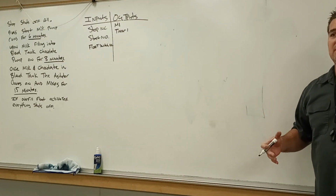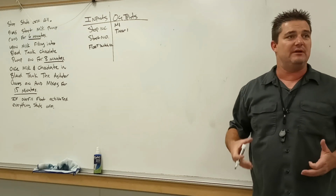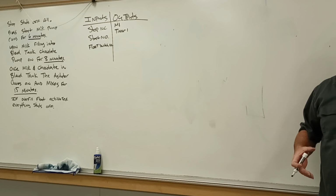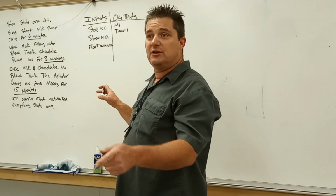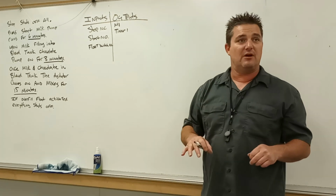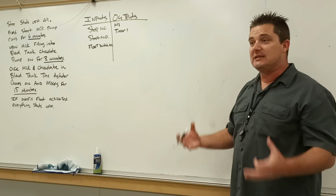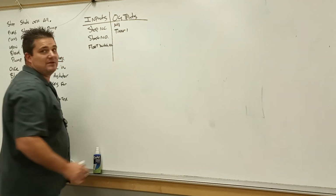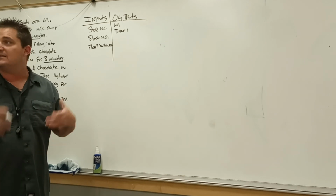What do you notice about the motor starters, and what are some of the additional components that we could use to keep this timer energized? Do we need a control relay? Yes, you can use the motor starter. You could use the motor starter, or we could have it with the control relay, right? Because the motor starter typically has a normally open set of contacts that are in parallel with what's starting it to keep that thing sealed on. So I'm just going to use my memory circuit from my motor starter and my timer and just omit the control relay because I have that part.